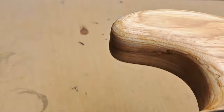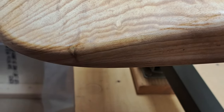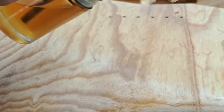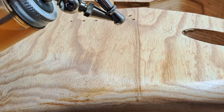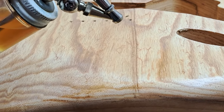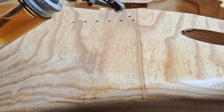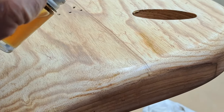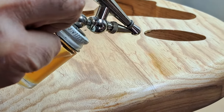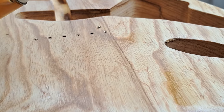Now I'm going to show you the other technique before I flip it over and do that to the back. This just takes — I mean, if all you had to do was that, you could clear coat this in 15 minutes. Now I've got the light right on my deep grain here. I'm just going to paint that grain away. I'm doing a little more than shading right here; I'm going to drop that on pretty deep right there. I don't like that grain. There's no reason you can't go for perfection before you touch the guitar. Clear is expensive and it's not designed to fill grains. Your sunburst certainly shouldn't be filling grains. That will sand out flat now.